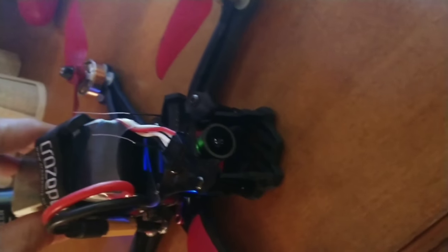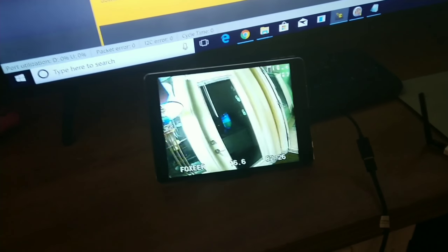I flashed the latest version to my F7, did a motor check, calibrated the motors in BLHeli_32, and from top to bottom adjusted the settings to my liking. The VTX and camera are working. Remember the SmartAudio we put on TX3?